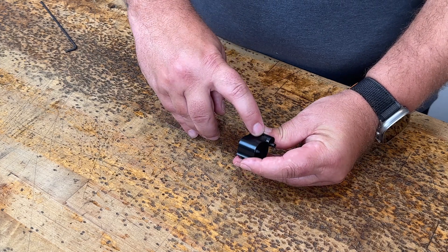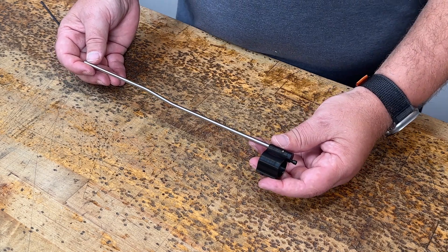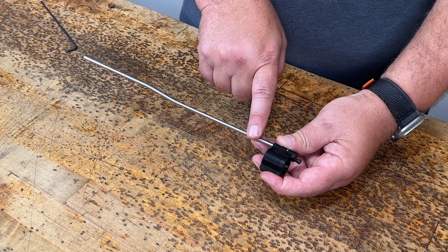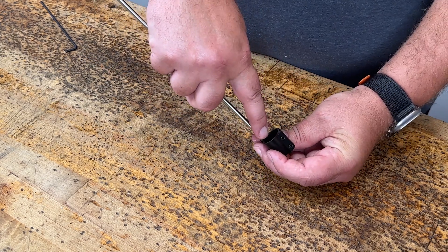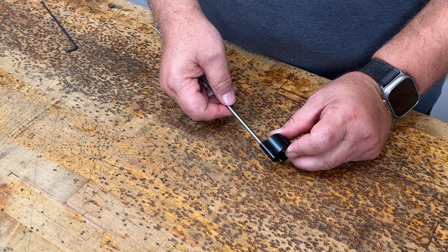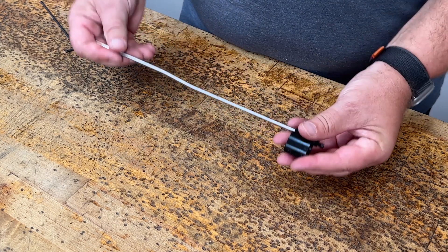Now let's take a quick look at installation. This is going to install just like any other 0.750 gas block. What I typically recommend doing is getting your gas tube and installing that first. If you have a vise or something of that sort, it's going to be very handy because holding the gas block still while trying to install the gas tube roll pin can be quite tricky. The adjustment screw is going to face forward toward the muzzle. The gas tube is going to come out of the opposite direction and kick upwards, meaning the port for the gas tube is going to be facing down and aligned with the port in the gas block itself. Once you have that aligned, you're going to see the alignment of the gas tube roll pin all the way through the gas block and through the gas tube, then put the gas tube roll pin in place.